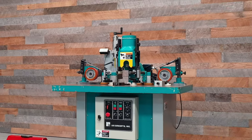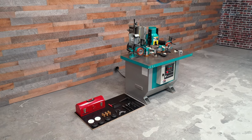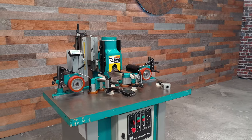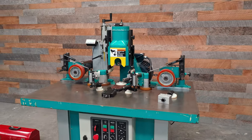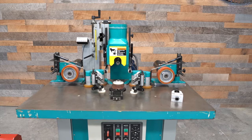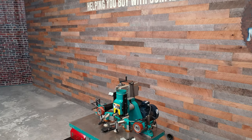This U.S. Concepts FAS-LX arched molder has a lot going for it. It has a lot of options like a cast iron table, forward and reverse on the spindle and feed speeds, a digital height readout, and the straight-run feeder with two gearboxes and fences. The 6-inch long inch and a quarter spindle is powered by a 7.5 horsepower motor. The spindle will tilt to 52 degrees, while the feed is capable of 0 to 30 feet per minute.